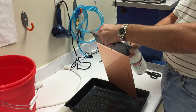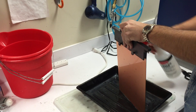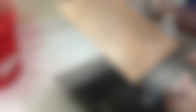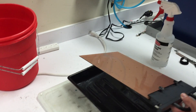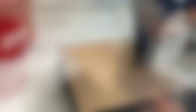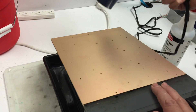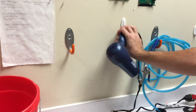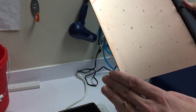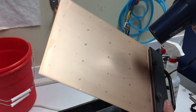I'm going to make sure I spray water, especially into the bigger holes, to get all the soap out. This rinse should not have as much soapy bubble action. At this point, I want to dry the board off so there's no residue left, so I'll use the hair dryer. We'll use the hook and put the hair dryer back. We'll give it one more inspection — there might be a couple drips of water. The important thing is to make sure there's no water left in the holes. I see two holes that still have a little water in them, so one more time with the hair dryer, I'm going to focus the air onto those holes.